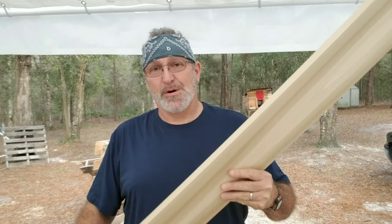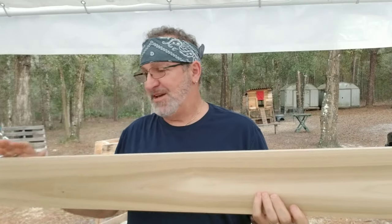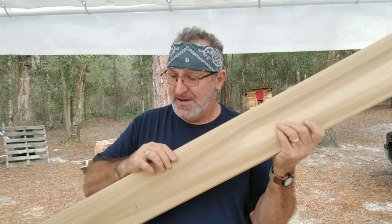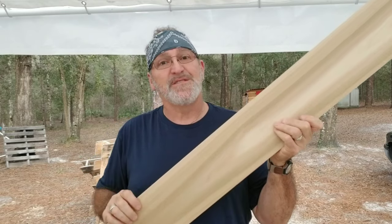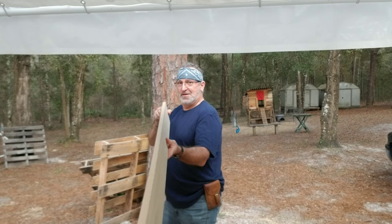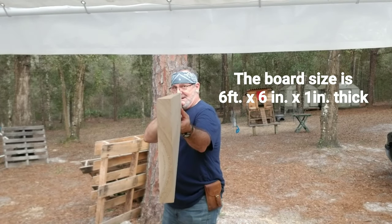So what do you do? What I do is I'll get a board — either poplar, sometimes oak, sometimes others. This is six foot by six inches wide, but don't let them fool you: six inches wide is really only five and a half inches. I'll look for a nice straight one like that and just rip strips of 1x2s out of this wood like this. Why am I wearing this headband? Well, I'm a really big fan of the Rambo movies. Just kidding — it holds my pencil. Let's get to work.